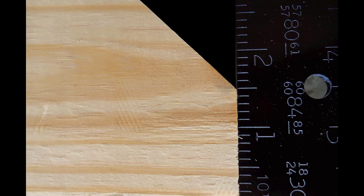Place one side of a framing square across the bottom of the board, not the top. You calibrate the centerlines off the bottom of the board only. On the opposite side of the framing square, look at the measurement on the square where the bottom of the angle cut meets the square. Whatever that measurement is, that is what you calibrate the centerline to.